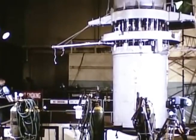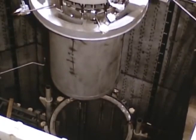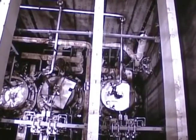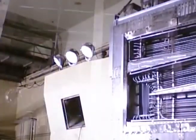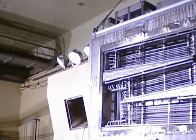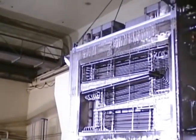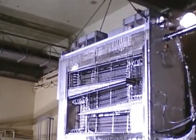The fuel storage tanks with steam cooling systems were positioned inside the electric furnaces. The salt piping and all auxiliary services including instrumentation and controls were thoroughly checked for leaks and electrical continuity. Since heaters and thermocouples as well as the coil were installed in the radiator enclosure at the shop, no additional work was required before the radiator was placed in the coolant cell. Installation of the radiator, salt storage tank, and circulating pump completed the coolant circuit.